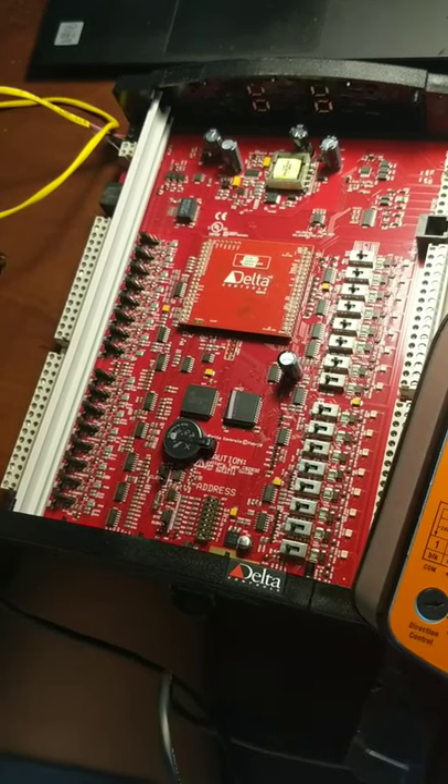The unit is moving to its initial position — I set it to zero volt. Now let's see what it does when I turn off the power. Yes — see, it's moving! I was surprised. It does have spring return. That's very fast actually. So counterclockwise is for the spring return. When there's no power, that's the position it moves to.